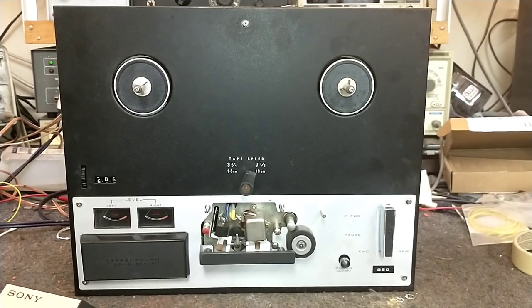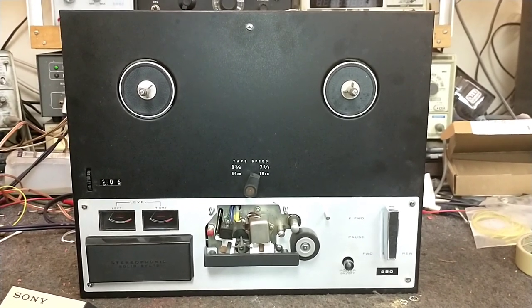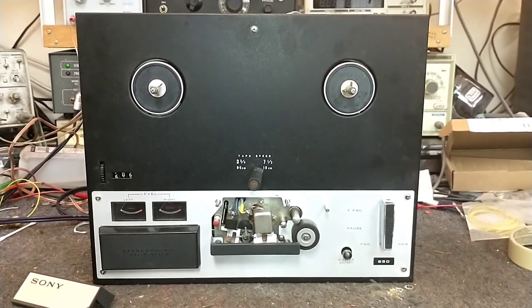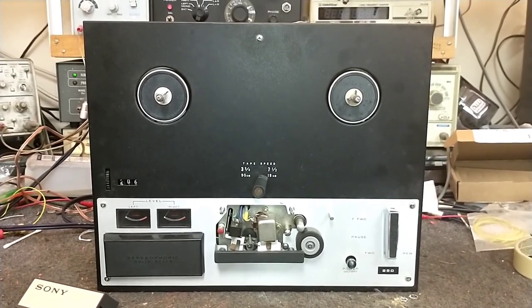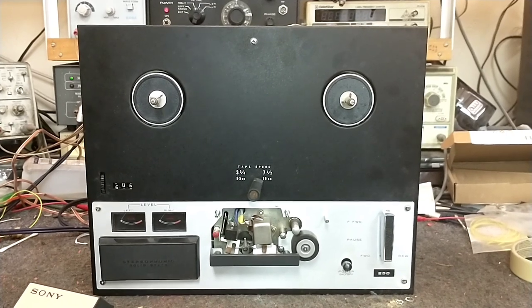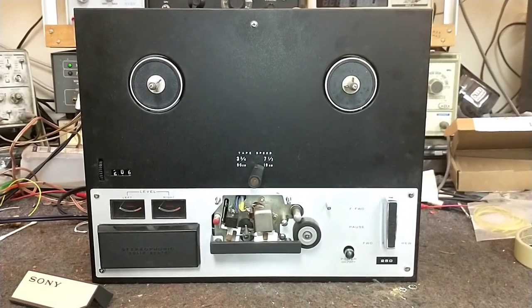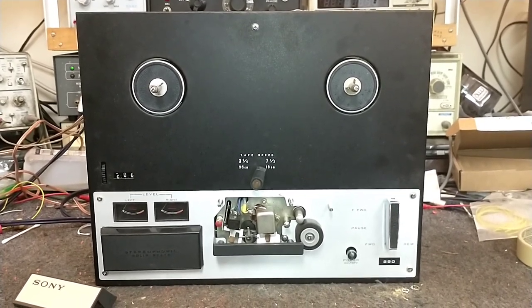He also said that the head alignment was wrong and it sounded awful, and it immediately slows down after about 30 seconds of playtime — slows down to a stop and then has no torque to get going. My guess is the infamous motor phasing capacitor in here. Usually it's like a 1.5 microfarad — it just gets leaky or shorts and the motor stops working. So we need to look at that too, but first things first, let's get it out of its case.